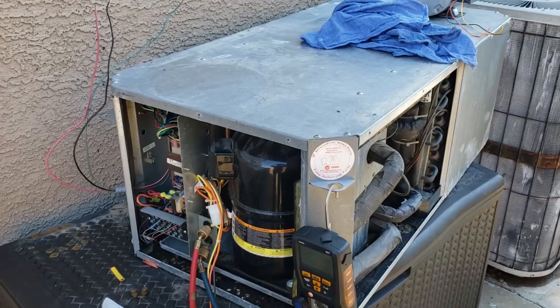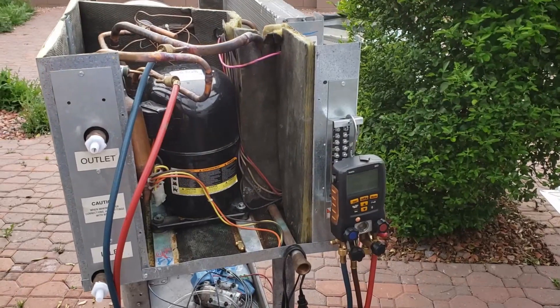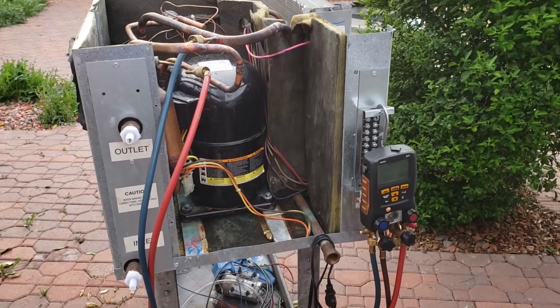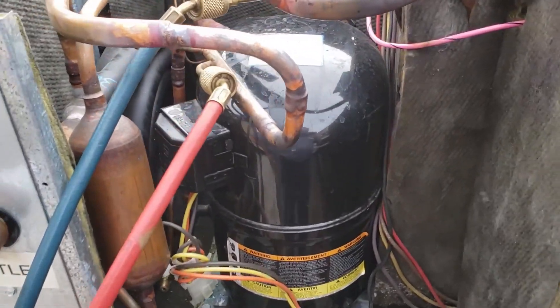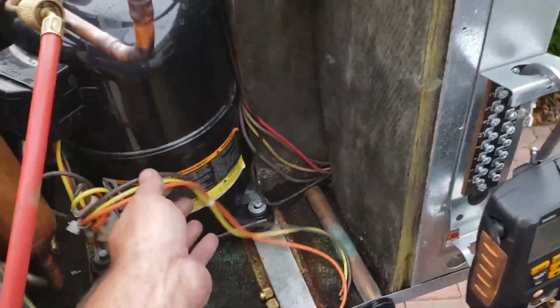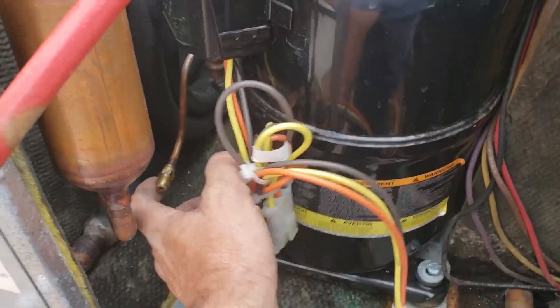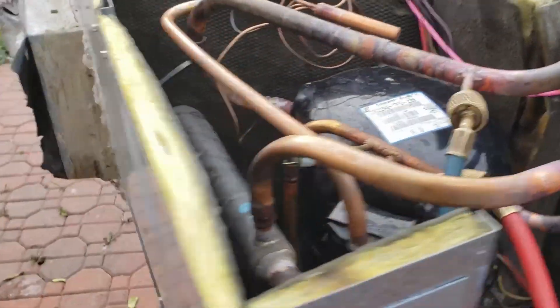I measured the shelf in my garage that's very close to the water heater and I have plenty of room to fit that mammoth cabinet in there. So last night I worked on this unit until it got dark. I left it on nitrogen after changing the compressor. The good news is 200 psi - that's where I left it yesterday. So I'm ready to blow that out and begin vacuuming this down. There's a high side port right there, enough to put a micron gauge on it.